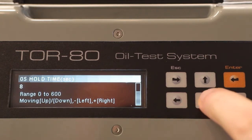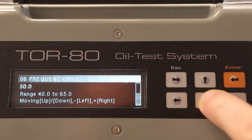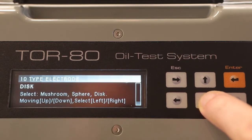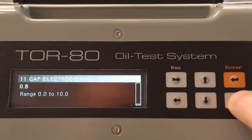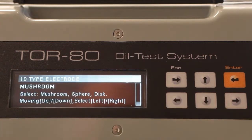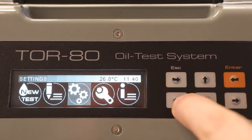The third setting is the frequency and the limit of the testing voltage in hertz and volts, respectively. The type of electrodes and the distance between them in millimeters are also selectable. For measurements, you can use spherical, hemispherical, or cylindrical electrodes. After that, you can start a new oil test cycle with the new settings.